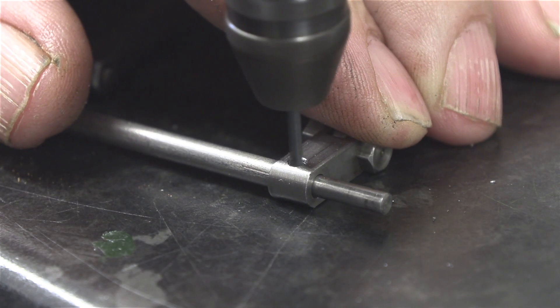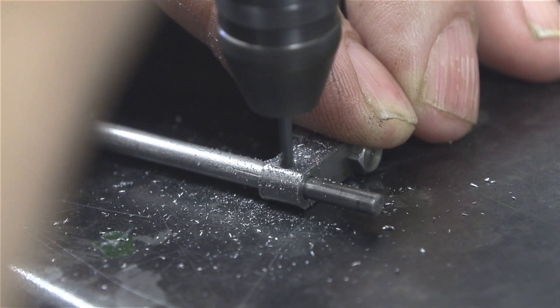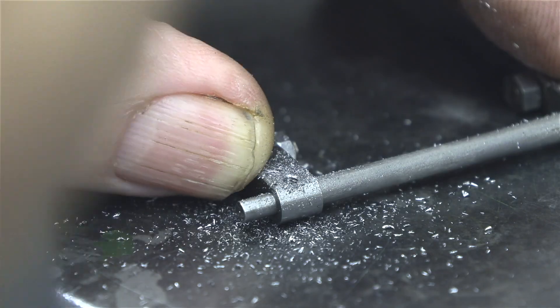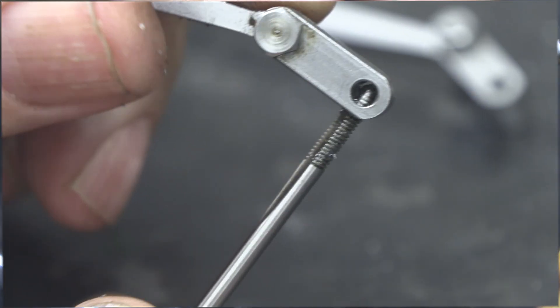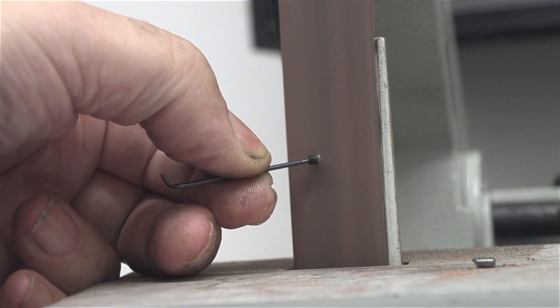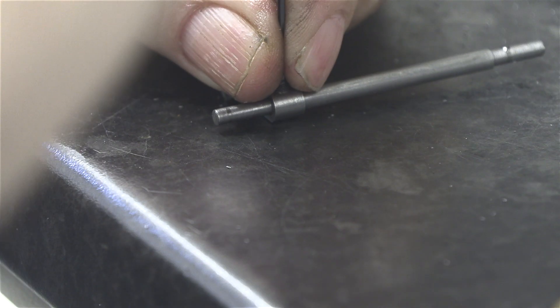Back to the job at hand. What I'm doing now is drilling a detent. I'm using the same size drill as a 7BA bolt, and please note — I am not drilling the hole all the way through. A detent is just a depression to take the tip of a bolt or a grub screw. Once I re-thread the hole in the fitting and fit a 6BA grub screw with the end ground to a point, this should hold the part very rigidly in position. This clip shows the 6BA tap still in place after I threaded the hole. With the grub screw fitted on the allen key so I don't burn my fingers, I'm shaping the inside end of it to match the detent in the cross shaft. Once this grub screw is tightened into the rocking arm, it's going nowhere.